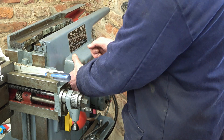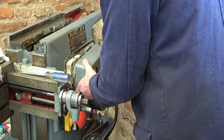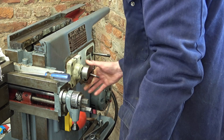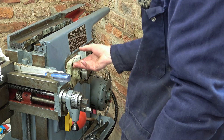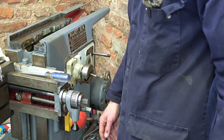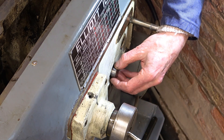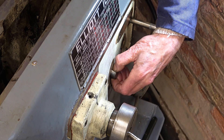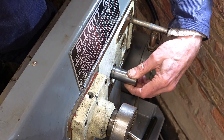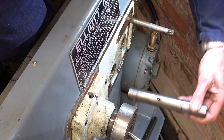You can use the clutch to push the panel off. It's quite heavy. This is the big bearing bush for the bull gear. That's the shaft that's been going backwards and forwards clanking away. I thought I was going to be stuck getting this shaft out — I thought I might have had to take the big pulley off and push from the other side — but by wiggling it I can extract it. You can't get it wrong because it's longer at one end than the other.